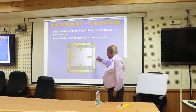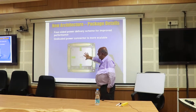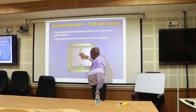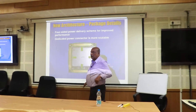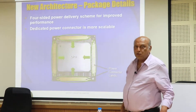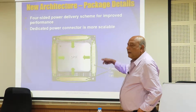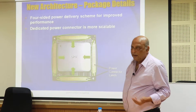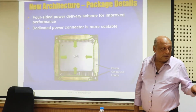So this is eventually what the package looks like — power supply connects here, this is where the metal fin gets connected at the end, they put a glue here, that Dupont glue, push it in, air flows, it cools down, and the power supply gets connected right here on the top with the VRM — the one you work on every day, what you have been doing some simulation on. So this is a four-sided power connector people designed, but they change it every year because all new innovations come. Conceptually these are the problems.